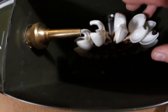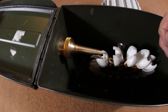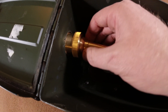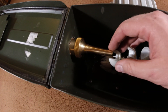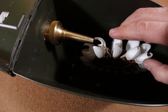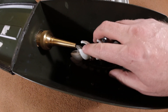You can see the jet here, obviously to provide the water. That's not a fancy jet designed specifically for a Pelton wheel — that is a jet off a garden fountain, quite cheap at about £4 delivered. You can actually adjust the position with a ball joint, so you can get the alignment absolutely spot on. The outlet size is about 6mm across. I think that's a bit big for this Pelton, personally — with the water supply I've got it would be more efficient with a smaller diameter nozzle.